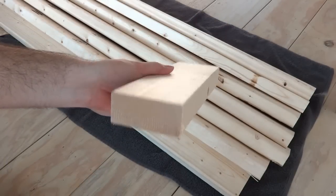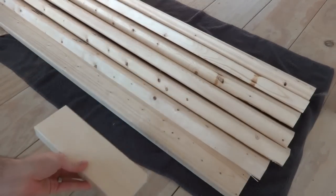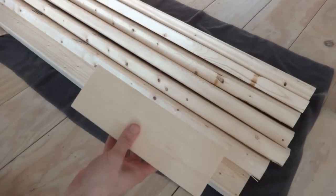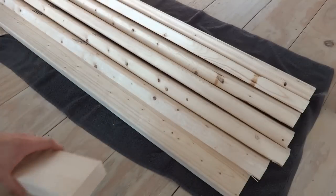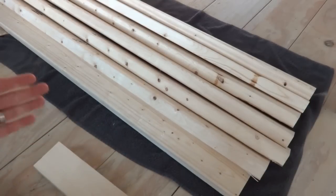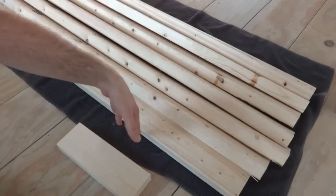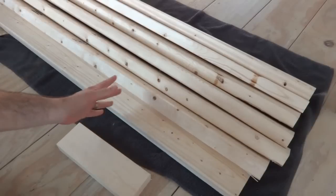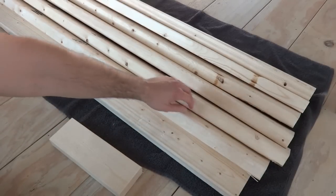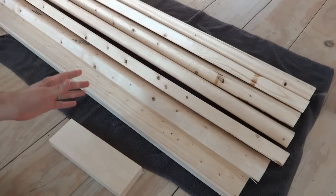We can smooth them out with sandpaper and finish them later, but first we have to chop them down. I'm using 8-foot pieces because the math works out nicely. When you take your 10½-inch piece and start chopping up an 8-footer, you'll get 9 usable pieces out of it with a little left over. The Jenga set has 54 pieces and 54 divided by 9 is 6, so you need at least six 2x4s that are 8-foot long. I actually have 7 because some have knots or bad edges, so I can cut those parts off.